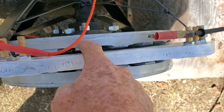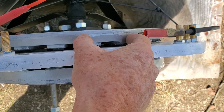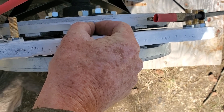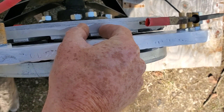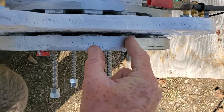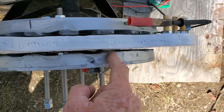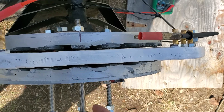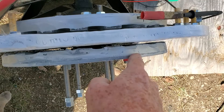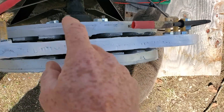When I did that, I just left it for the night. Came back in and on each rotor there were two together in the morning, and one like this on this rotor. They were squished together, and this rotor had two together when I came in to check on it in the morning. So I had to make a jig to pull the magnets back apart again with some stainless steel all-thread, which took me almost a whole day, and I did that while the resin was still on it.